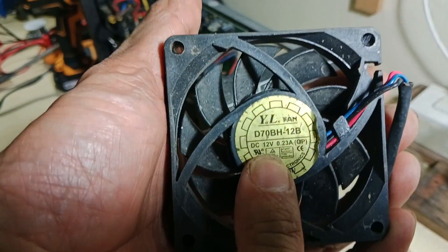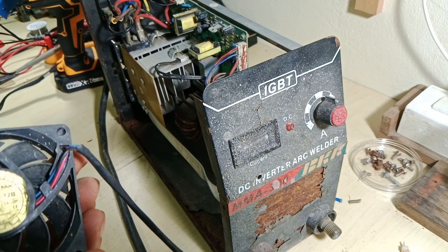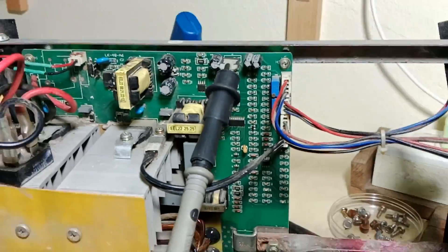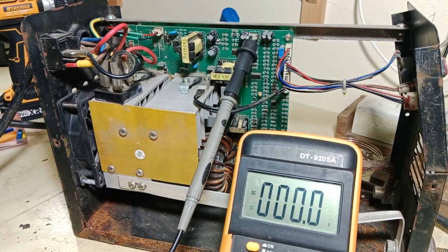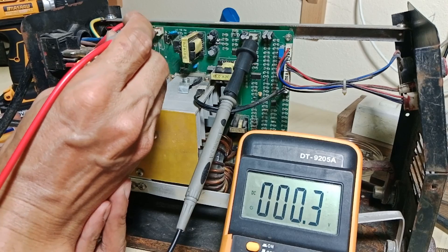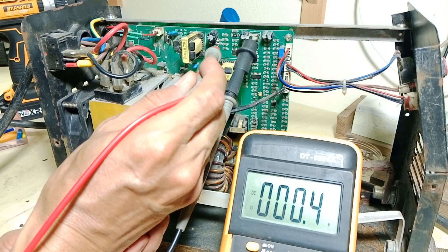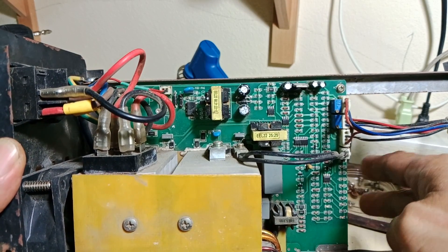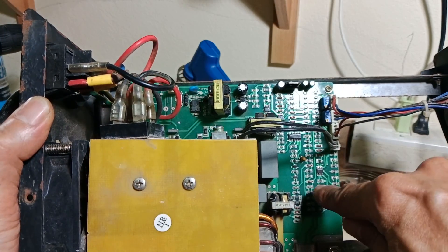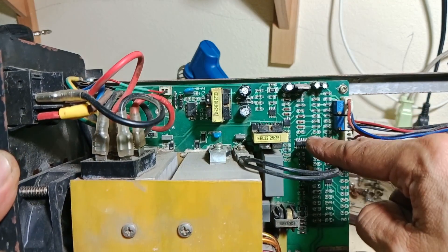If we look closely at the additional fan, we can see that this is using 12V input, while the fan in the inverter welding machine is 24V. Connecting the additional fan drops the DC voltage on the auxiliary power supply circuit, causing all the other parts of the board to not get the correct supply voltage. The correct output DC voltages of the auxiliary power supply for this machine are approximately 24V and 15V. The 15V is the power supply to the PWM controller, and if this part does not get the correct supply voltage, the inverter welding machine will not work and so there is no output.